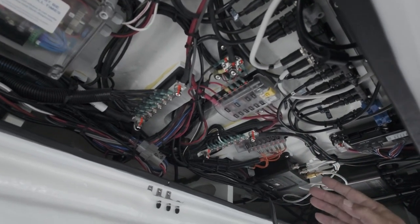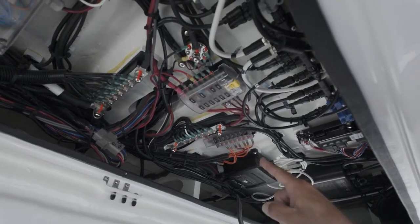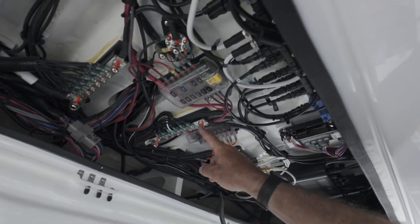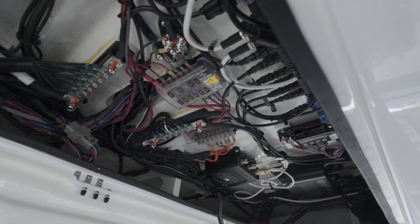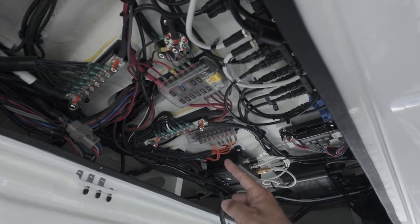The most important thing to this is those orange stripes. We shamelessly stole that from the helicopter business. Why? Because I'm a novice electrician, but if that line moves over to here and that one stays up, that tells me that wire is loose. What a great visual aid it is for an owner to determine how the electrical is. And everything is torqued and sealed.